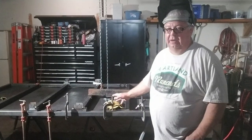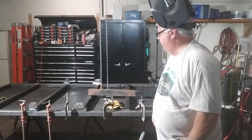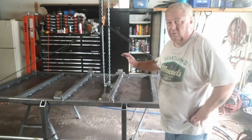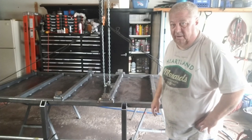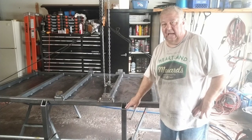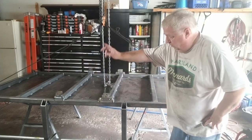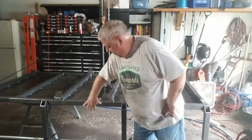We're going to start welding and get this all tacked in, then get back to it once we start putting the axles on. I got the plate welded to the frame — there's no turning back now, it's solid. I got the brackets welded on for the axles and also made up some sides. I cut them while I was cutting everything else with some extra tube — putting four on each side, somewhat evenly spaced. The fender will be somewhere in the middle.